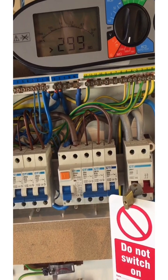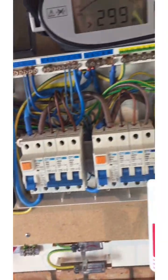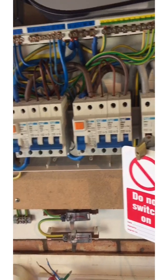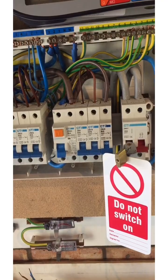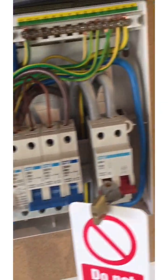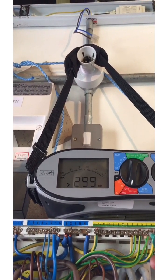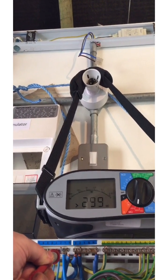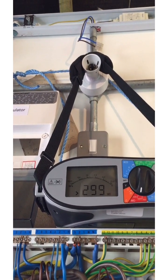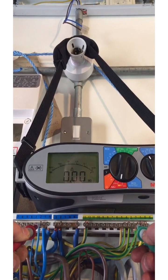Let's pick another type of fault which is slightly more tricky. If we dial in a neutral to earth fault — now that's different. If it involves the line, we can use the breaker to isolate it: line to earth or line to neutral, we can use the breaker. But if we've got a neutral to earth fault, the only way we can isolate it is to actually start taking cables out, because obviously we can't just flick a switch and disconnect those individually. So let's see how that behaves. Let's go line to earth — okay. Neutral to earth — that's where we're getting our zero. And line to neutral — we're okay there. So neutral to earth: that's a straightforward neutral to earth short.